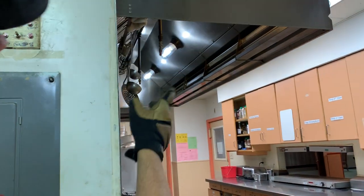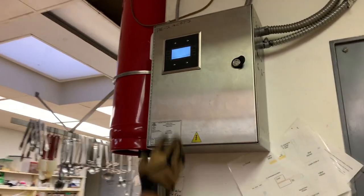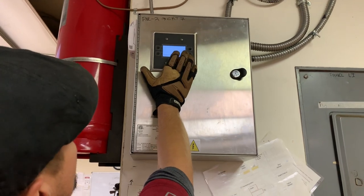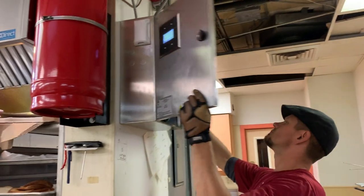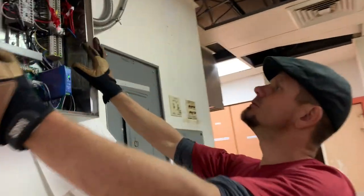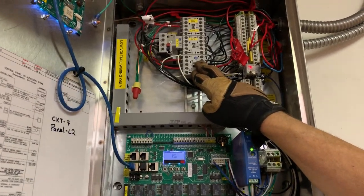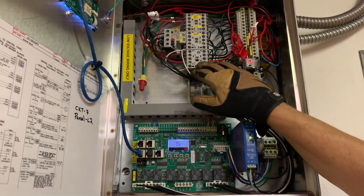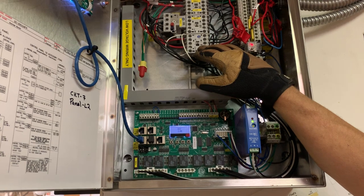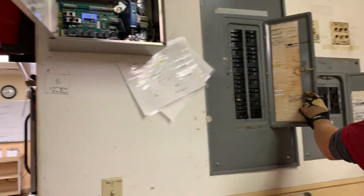This place is pretty old, so typically it's going to have its on/off switch the old school way. This new panel is going to turn on here on this side with the lights. Inside here we have a few contactors — like an ice cube relay — these are soft coil contacts. This ice cube relay with these contactors is what's going to be turning on and off the makeup air, which does this side of the hood.